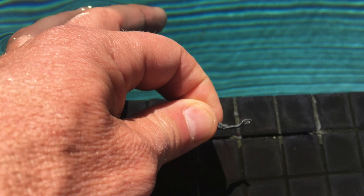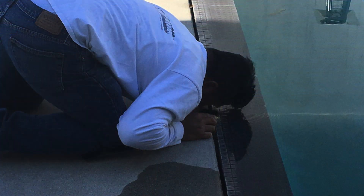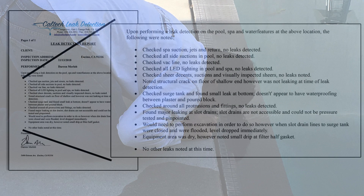We actually had a piece of material that fell into that hole — I'm showing it here so you can see it. When we raised the level of the pool and water was running over that beam, we had water penetrating it. We confirmed that with dye, so we were able to see it. When we heard what we did with the slot drains, we were able to get a light in there and found leaks at multiple locations.